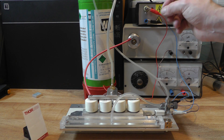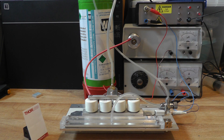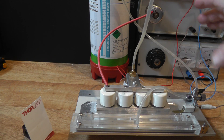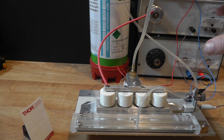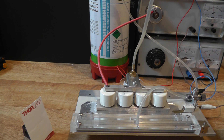The little triggered gap is capable of easily running up to 100 Hz — 100 pulses per second — which would be really incredible to see on this kind of laser. The future project will be to upgrade the power supply. Now that we can purposefully trigger the gap whenever we like, we can perform a series of experiments to actually optimize this nitrogen laser design — for example, how many volts should we really have discharging across the channel? Currently we're sitting at about 19,500 volts.